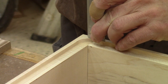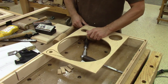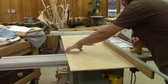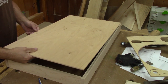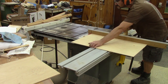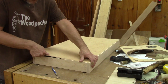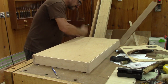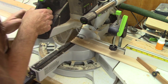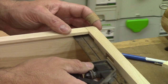The last pass is done the normal way. Now I need to make all the corners square. When I'm sure they are OK, I can cut the back plywood. I cut it a bit too big, so I need to sneak up on the right size. Now that I know the back is the right size, I can measure the length of the small planks for the shelves. I use this measurement to cut the planks, and I also need to rip them to the right width.